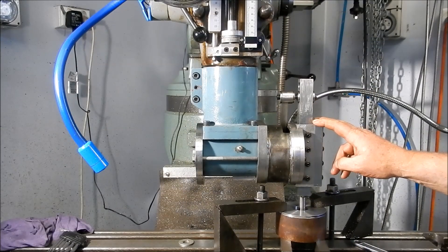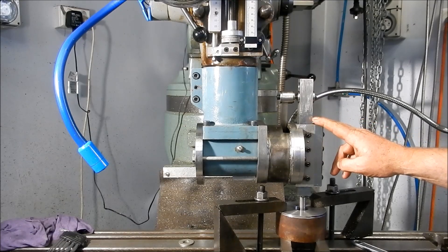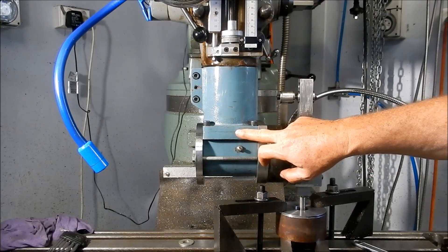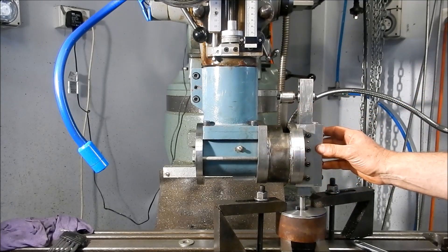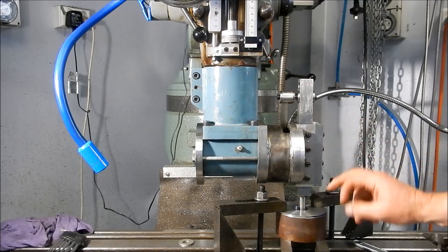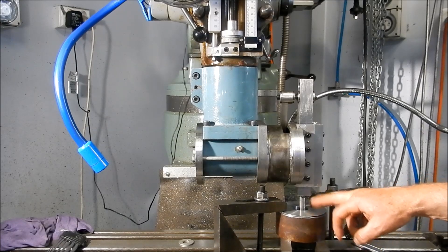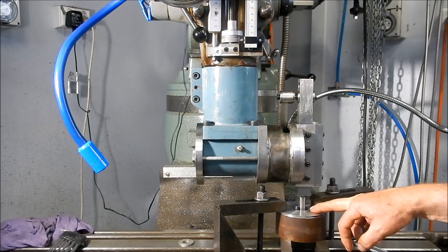There's quite a lot of interest in my previous video on this little slotting head that I designed and made probably about six or seven years ago. I've utilized the horizontal head for the mill and adapted the slotting head onto it. We're going to be slotting at 55 millimeters and I've got a six millimeter cutter in there, so I'm going to go three millimeters deep as a standard keyway cut.